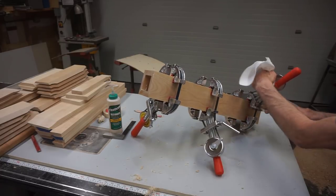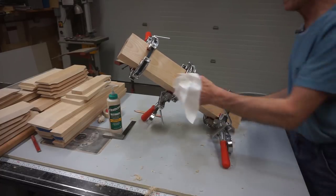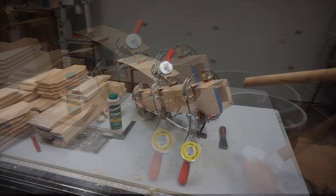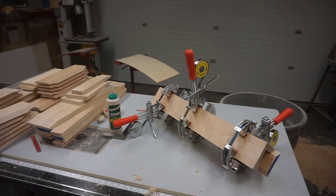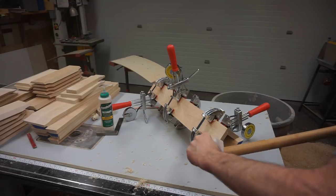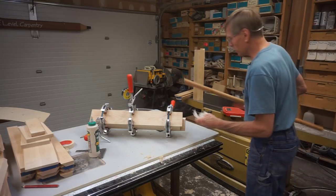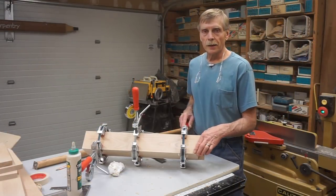These columns will get stained with a dark brown stain — the last thing I want is smudges from mopping with a wet rag. It cleans up pretty nice. I made a little acute-angled scraper on a long stick that I can slide down inside the column and pull the glue squeeze-out out of the inside corner. Someone could argue that excess glue actually makes the column stronger, but I wanted it cleaned out. Originally I was going to slide a support post inside to stiffen them during installation, but my friend Jared gave me an idea for a very secure, bomb-proof installation that doesn't involve a steel post inside.